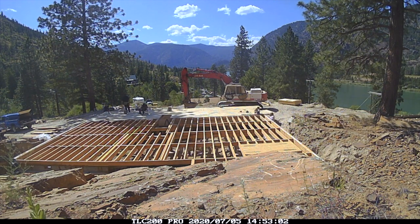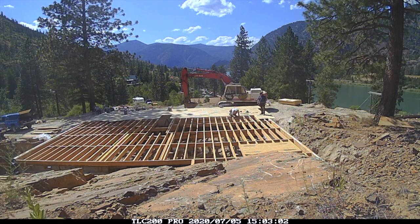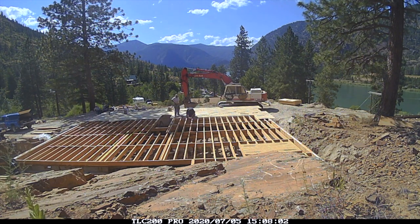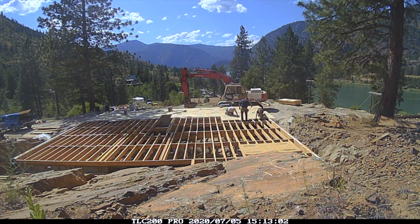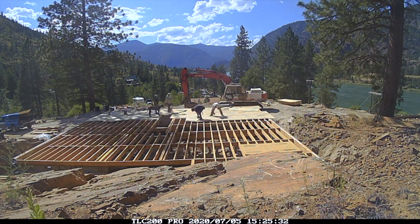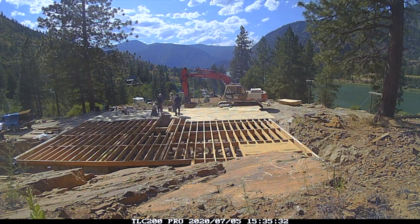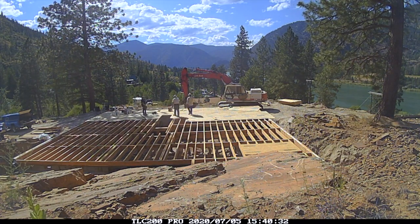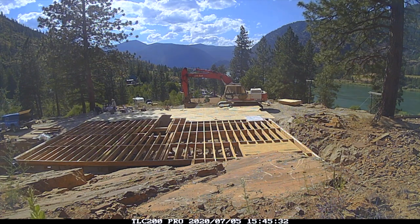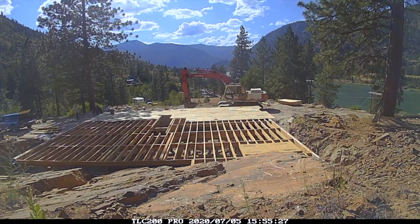When it comes to putting this down, I'm actually using two-inch screws — glued and screwed. It seems like overkill; you'd probably shoot it down with twist nails. But I knew that glued and screwed was never going to squeak, and I just hope it was worth the extra time and effort.